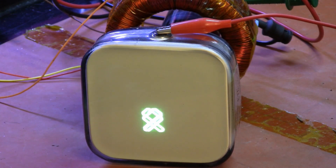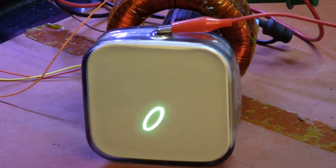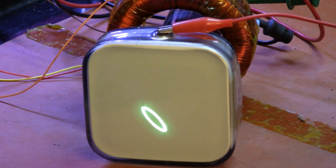This project is a complete success. If we switch to sine waves and make them the same frequency, we should be able to produce a circle. More or less. The experimental deflection yoke works. I encourage you to get a ferrite ring and a CRT that this ring will fit on, and wind one of these for yourself.